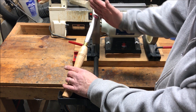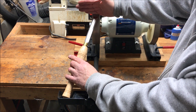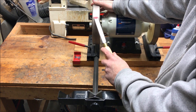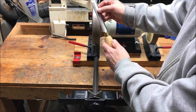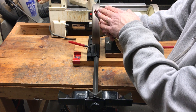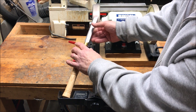Notice this — this is incorrect. See how this tool is at roughly a 45 degree angle from the wheel? You want to flip it over. You want the tool to be square or at 90 degrees to the wheel. When we move it to the other pocket, we rotate it, set it in this pocket, and then we can grind from this side. The way you find your angle is you set the tool in the pocket and rotate the wheel. My angle is not exactly perfect — I'm right on the center of the tool, because I sharpened this tool quite a while back and I've been doing a lot of stropping. This is the angle I'm going to use. We're going to go ahead now and sharpen the tool.